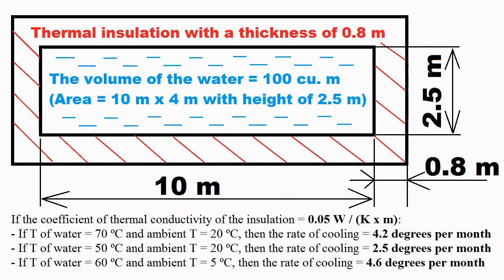This version should take heat in the summer and store it until the winter. This storage has 80 centimeters of thickness of thermal insulation, and therefore it achieves a rate of cooling such that 60 to 80 percent of the summer heat is stored until the winter.